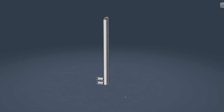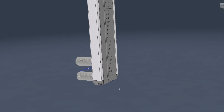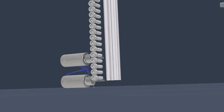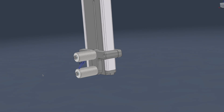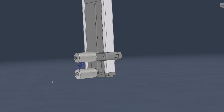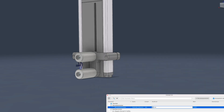This is in my opinion the simplest setup to count and eject the screws in a controlled way. It uses two solenoids. If we hide the magazine parts we can see that the ejector is blocked for the screws. In the next step the lower solenoid retracts. I call this the alternating approach because we're using two solenoids which are always in opposite states. In order to adjust the screw quantities we need to adjust the distance between both solenoids. For this I use a parametric design — that means I can change the distance by typing in a new value.